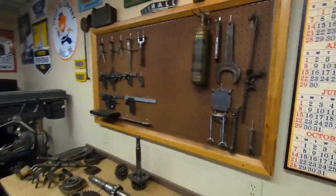So that pretty much proves 1113's been a drawbar tractor its whole life. It never had a blade on it, no indications of blade mounts, anything like that. The pinhole in the drawbar is getting a little bit egg-shaped, but that thing got put in fourth gear and stayed there probably for half the day until it was lunchtime. And then after lunchtime, it was back into fourth gear probably till dark or a little bit after. So that proves without a doubt 1113 was an agricultural cat. Probably did things like light tillage, like disking, maybe planting. To have that high of a ground speed for that many hours gives us a glimpse of the history on the machine. Kind of interesting, I think.